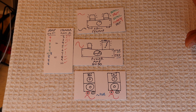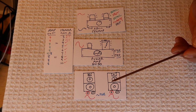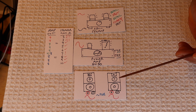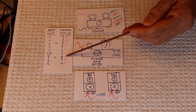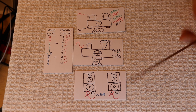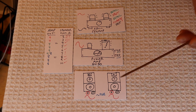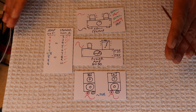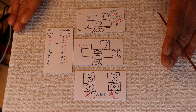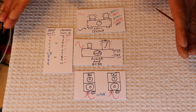Speakers will have what's called a nominal impedance. These days, there are almost always going to be a nominal 4 ohm, 6 ohm, or 8 ohm impedance. What is impedance? Impedance is electrical resistance. In speakers it's fairly complex because the impedance rises with the frequency of the signal, and an audio signal is a composite of many frequencies.